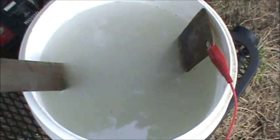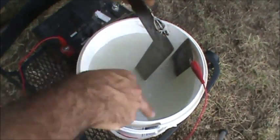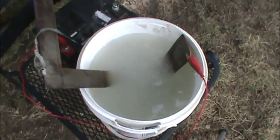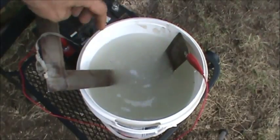One thing you could do is center the piece you're de-rusting and then put multiple electrodes around the outside. You could wrap a piece of sheet steel around there too. What will happen is it'll work on the side facing the electrode and not on the other side as much.